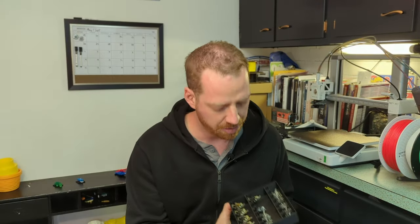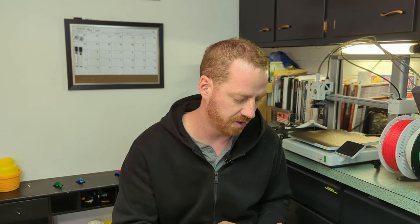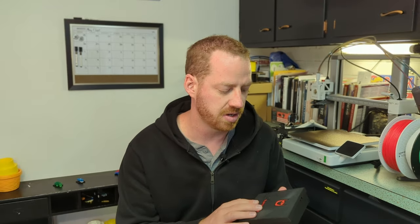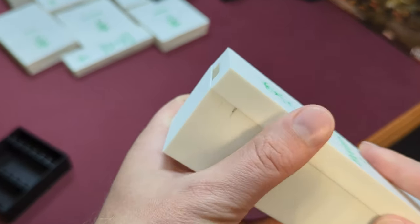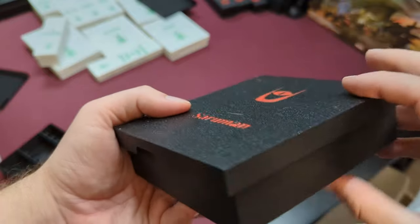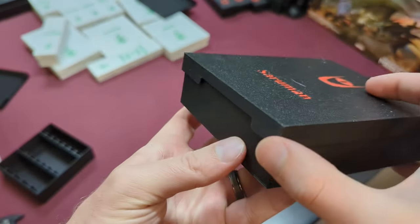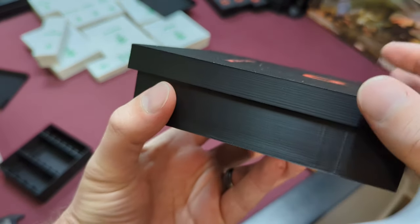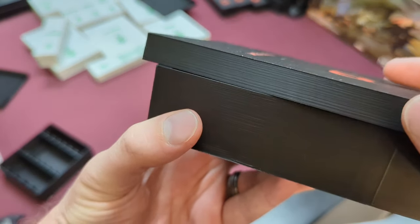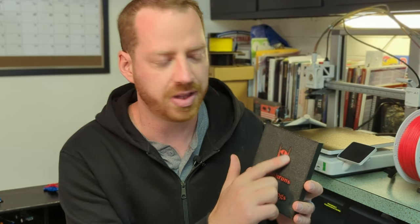Now that I had my basic box designed, I wanted to design a lid that could fit on here and secure it in place. Unfortunately this is where a lot of my mistakes came in — I kept struggling to get the exact measurement, it was always too tight or too loose. I finally figured out that if you take calipers and measure the box, then add two hundredths to each side, that's the perfect amount to make your lid snugly fit onto the box.